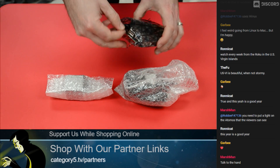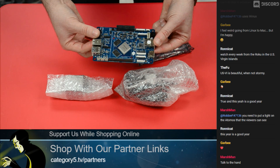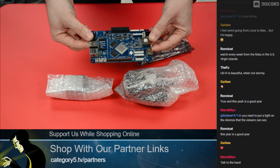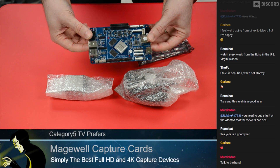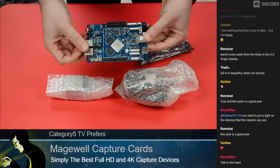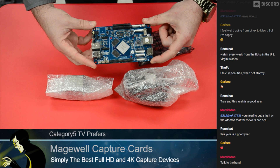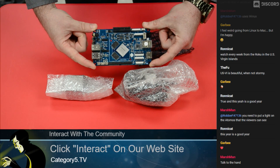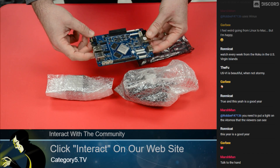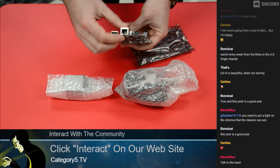There it is, at the same form factor as the A64 from Pine 64. This one is massive as far as specifications go. It has an RK3399 hexa-core 64-bit processor — two ARM Cortex-A72 cores and a quad-core ARM Cortex-A53 — so six cores of processing power total. It also has a Mali-T860 quad-core GPU.